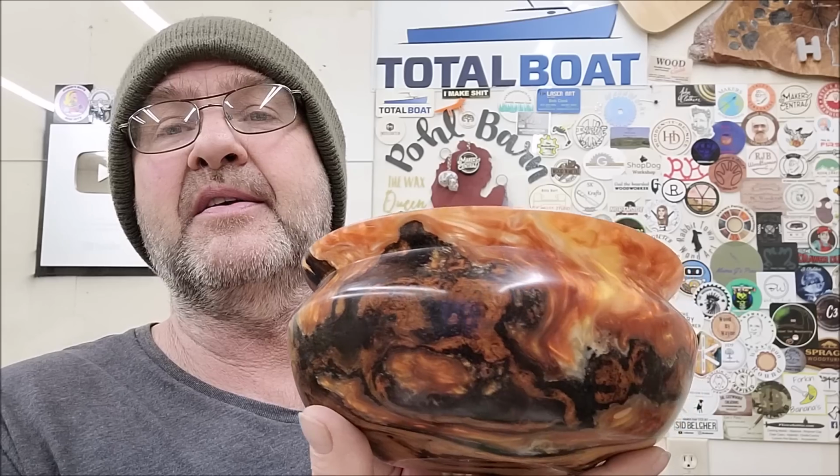what did I use, you guys? I haven't used it in so long. The shine juice. There you go. So, you know, three equal parts denatured alcohol, boiled linseed oil, and shellac. Yeah. I think there's a link for that video, how to make it, how to use it, in the description below. If not, it's over on Captain Eddie's channel. So we'll put that in the corner too. How's that?